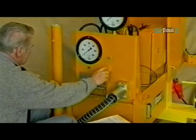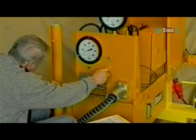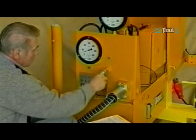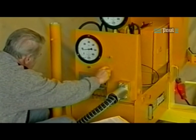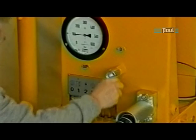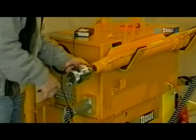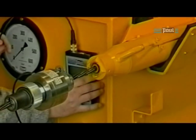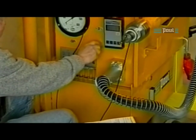The necessary stressing force is produced by means of the pre-stressing machine, consisting of a stressing jack and a hydraulic pump unit. The stressing force must be accurately reproducible and measured. A six-monthly inspection of the pre-stressing machine is therefore stipulated. First, a comparison is carried out between the tensioning manometer and the control manometer. A calibrated measuring device — consisting of the force transducer and the display unit — is used for the inspection.